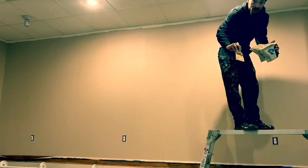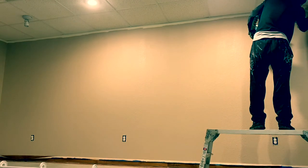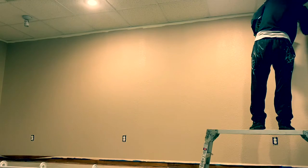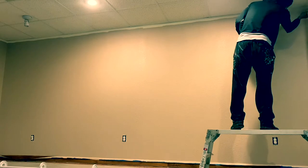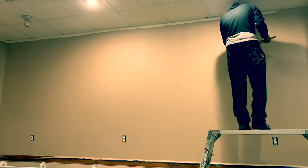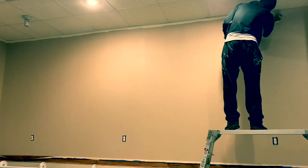I got paint on that brush but not on that side. And that's how, if I get a brush hair or so on the ceiling, I don't have to worry too much about it. I like to do a few inches at a time — no more than about a flat 12 inches worth of cut before I redip my brush. The texture on this wall is orange peel, so I kind of have to work it in a little bit. See how I'm working it like that?